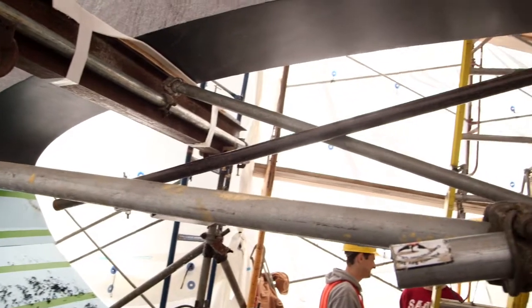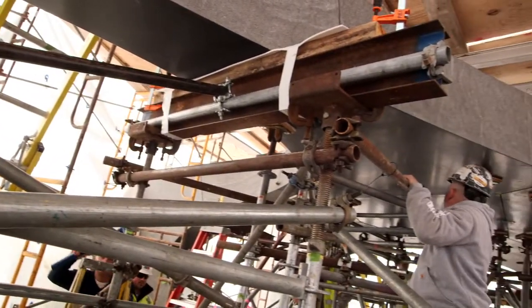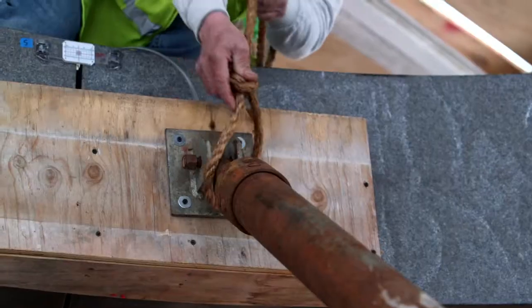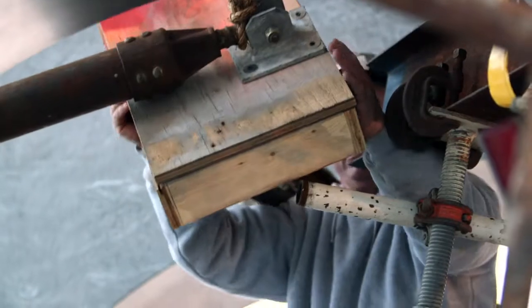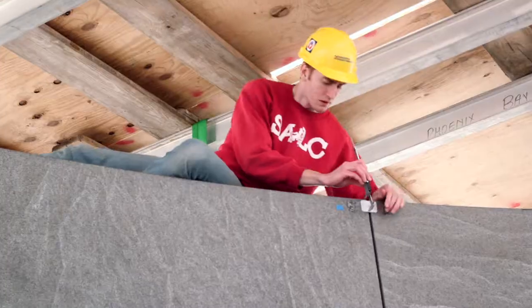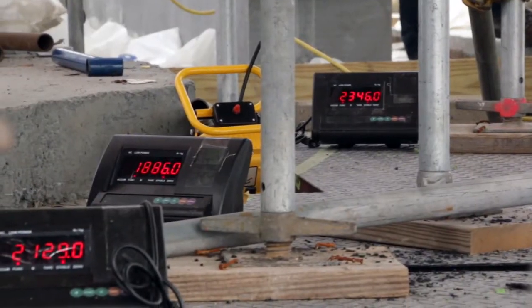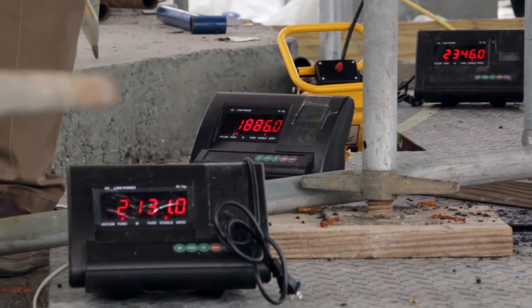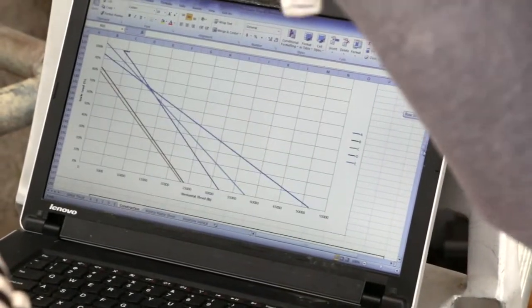The most exciting moment and the most critical moment in the construction is when we lower the scaffolding and the weight of the great keystone and the flat vault goes into the 5 walls, really for the first time. Come down. Hold on. Let me turn it, Johnny. Okay. We've got it instrumented for displacements in 25 different locations, and then we've got 9 scales underneath it taking load readings. So we're going to be doing real-time measurements of how the load is being transferred.